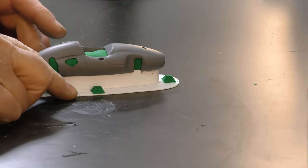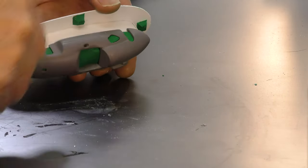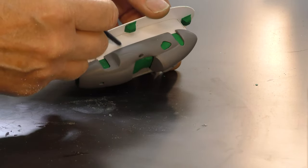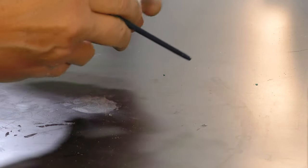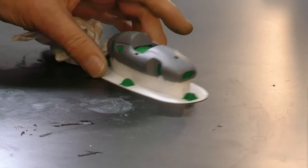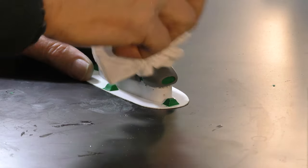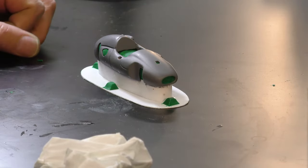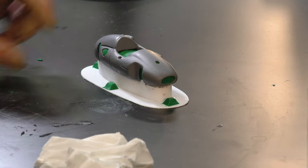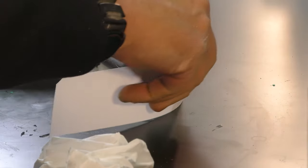So I do believe we're, except for putting the wall up on the outside here, ready to make a mold. Now this area here is going to be a bad spot for trapping air, because the bubbles rise up and get caught in here and don't move up onto here very well. So I'm going to put the material in the pressure pot — we don't want to cook it — and we're going to crush these bubbles as best we can. I may just brush some silicone up under here and around here right on the surface so I know I've got a good clean coating on there, then add the wall around it and pour the rest. Basically, everything we need to make a body is here.